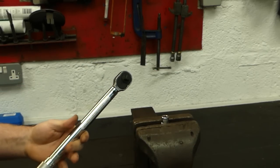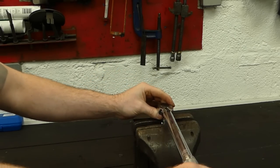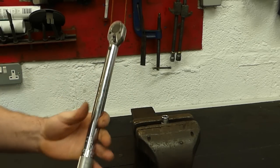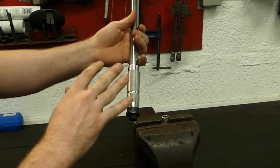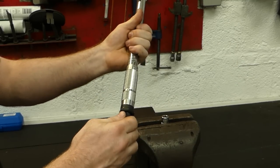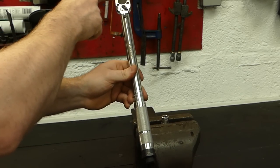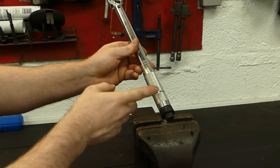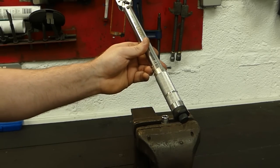I've got my 3/8 adapter which I've now locked in position in the vise. Anything stationary is good enough for this, as long as you can get your 3/8 into it in a lockable position and be able to turn the handle. Because of the range of this wrench I'm going to set it at around 29.5 on the foot-pound scale — that's a mid-range for this particular one. I'll then measure from the top of the handle down 12 inches and make a mark so I can pull from exactly that point.